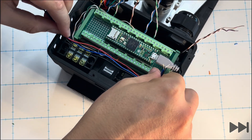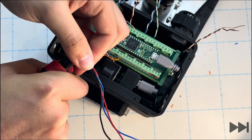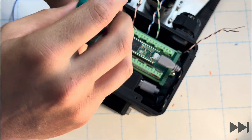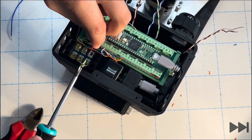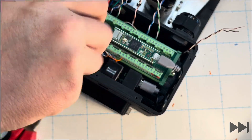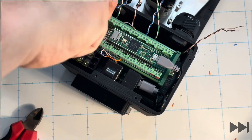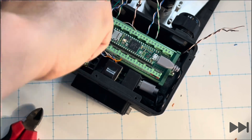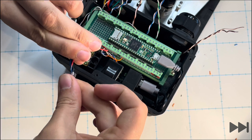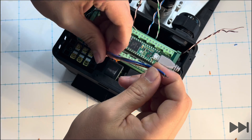Using offcuts from the motor wires, we measure them across the breakout board from the power terminal blocks in the bottom right as seen from the back, across to the terminal block in the back left. We connect these with the red wire on the right hand side terminal, the black in the middle, and the blue wire on the left hand side terminal. Once screwed in, we slip a sleeve of heat shrink over the top to make it neater and allow us to tuck it underneath the keystone jacks.